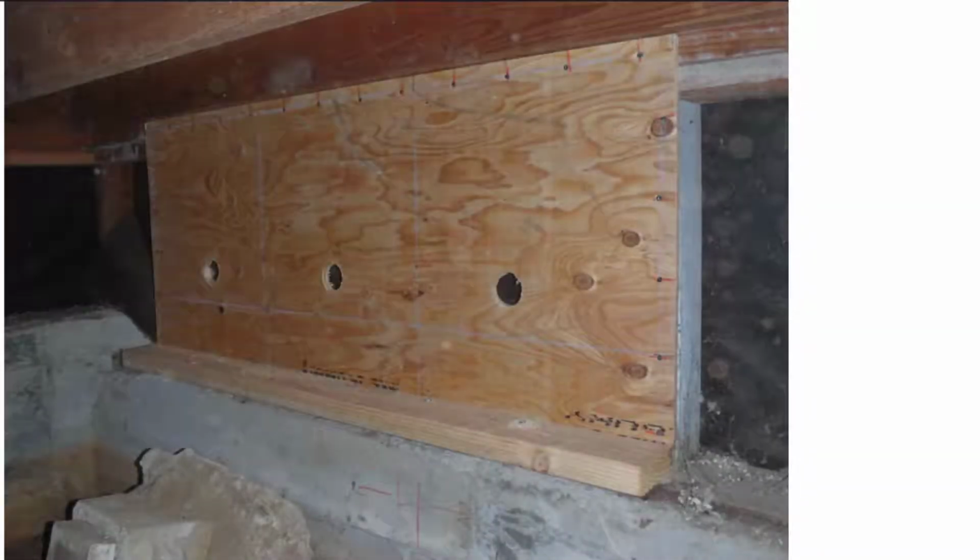So here's a photograph of a reverse block plywood connection. Here's the 2x4 that we were talking about, and this plywood has been nailed to it from the back like this. And so this is either, I'll show you here, here's the mudsill right here. Now what's critical is that there has to be enough mudsill right here. Probably 2.5 inches would be the best. It depends on whether you use nails or you use lag screws.